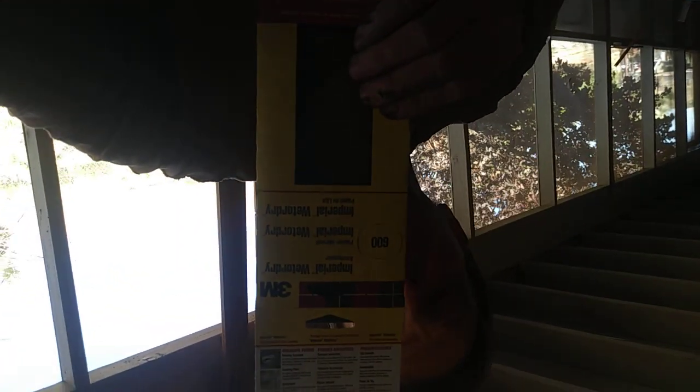I have a 400 grit. I even have a 600 grit. I may just slightly go over it with the 600 grit. Alright. And we'll see how that goes. 320, 600 don't quite do it. I'll go over it with the 400, but 600 may be like perfect. Alright, you just want to knock off the roughness off of the poly for your next coat. That's all I'll be doing. Usually you use 320. I have the 600. I'm going to give that a try and see how well it works. And you'll be seeing the finished product.